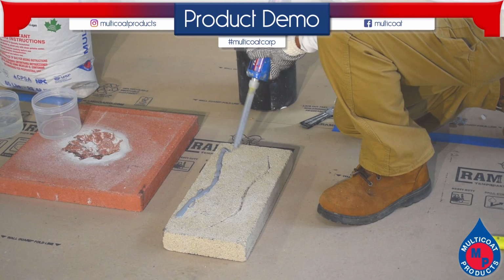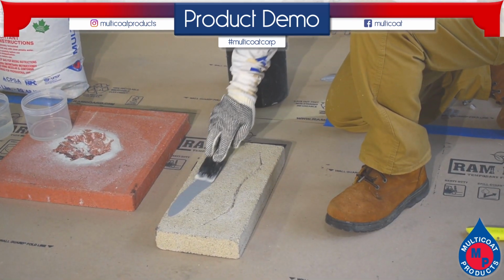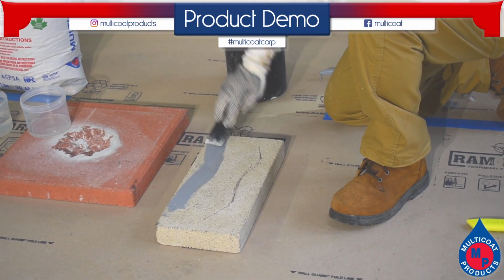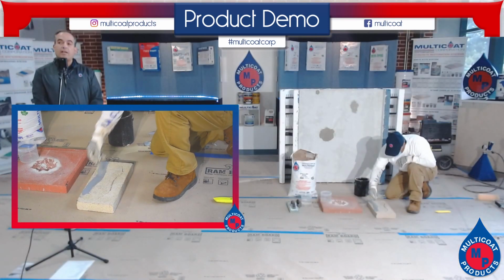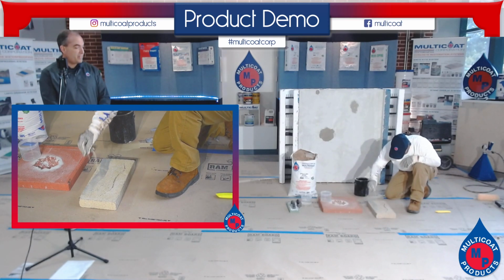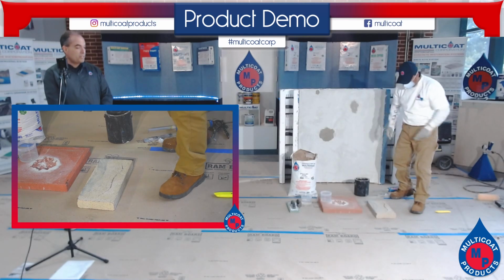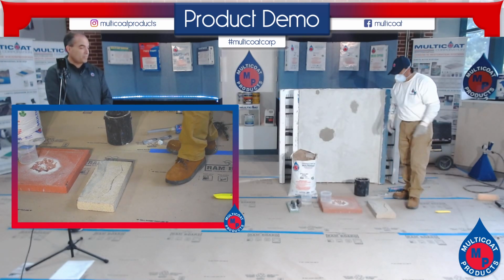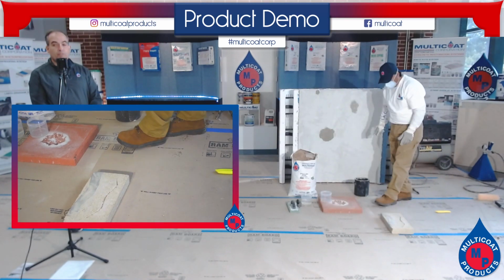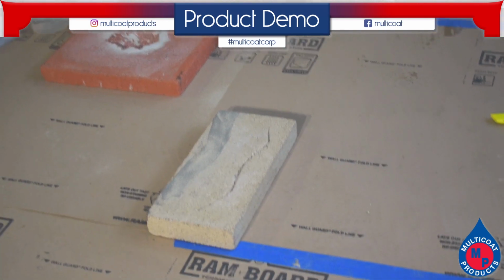If the crack is very deep, in order to save on some product, sometimes it's recommended you fill the bottom of the crack with silica sand and then come back over with our Speed Bond product. You'll get up to 22 feet of coverage with our Speed Bond. As you can see on the video, it is a concrete gray, so if you're doing a repair over concrete, it won't be too intrusive. We also sprinkle some silica sand on top of the crack, so if you're going to do an overlay over it, you get better adhesion.